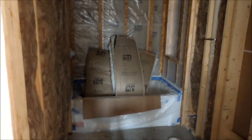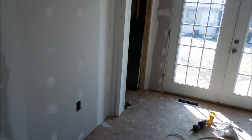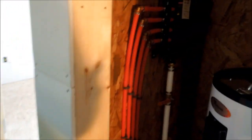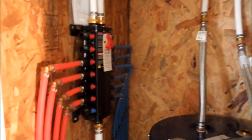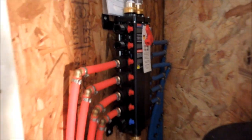The problem with daisy chain is that when you're taking a shower and somebody flushes the toilet or starts a load of laundry, your water pressure diminishes and you lose your water temperature — you can't maintain it. So you adjust, and then when the water quits running, the temperature goes way up and you scorch yourself. The PEX system kind of removes that from the equation.